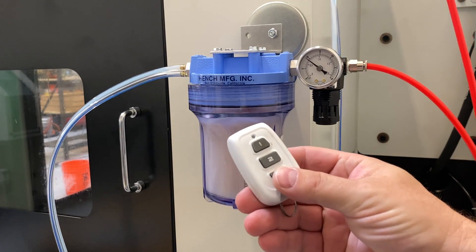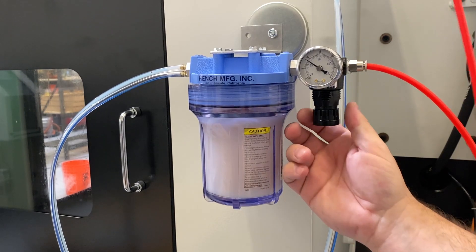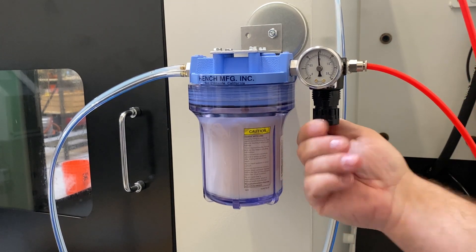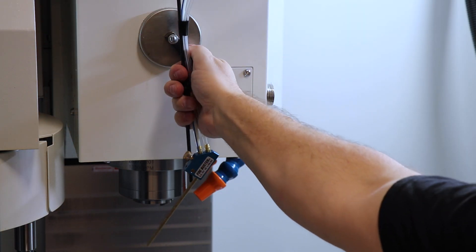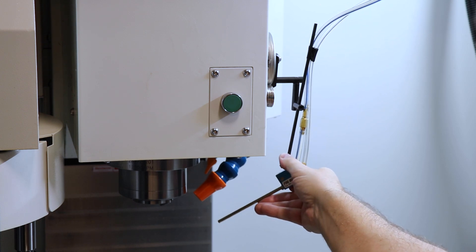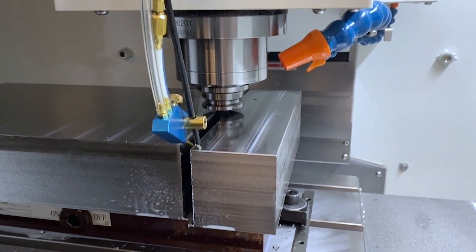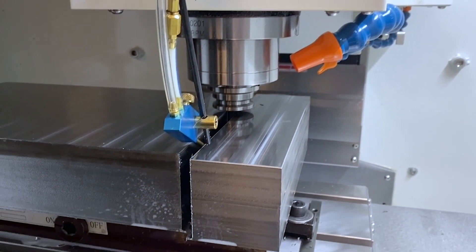Plumbing the Fog Buster is super easy. You can see I put it on a little solenoid with a remote that I got from Harbor Freight. These really run between 10 and 15 PSI — you just snap it up to lock it in, and you can use the same thing to shut it off. You can run this on the side of the machine or in a static position. Fog Buster sells a little standoff that allows you to run it in a single static position.